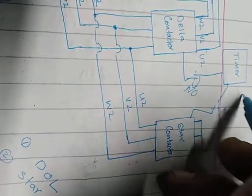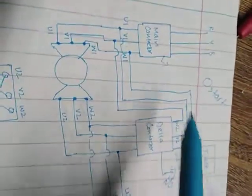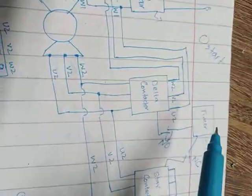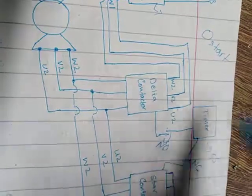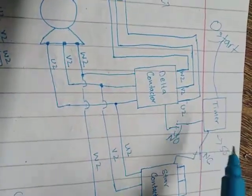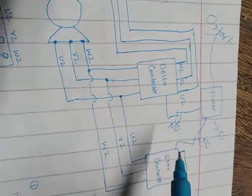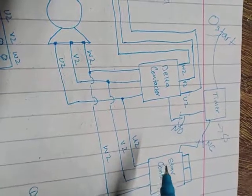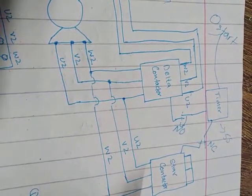So initially, let's set the time for five seconds. For five seconds, our main contactor is continuously on. The command goes from the start button to the timer, and for five seconds it will not energize itself. The voltage will come from the normally closed connection to the star contactor, energizing star. Let's see how the star-delta motor will move.